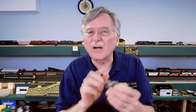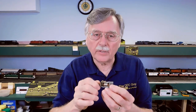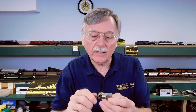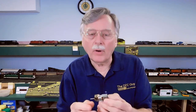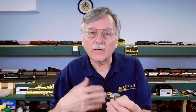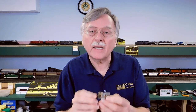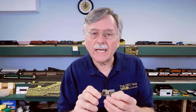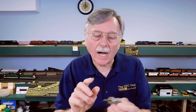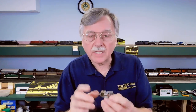Now, under most cases when we start applying power to a motor, it's going to start speeding up and you're going to get a slow increase in the amperage draw and the speed. As it speeds up, your amperage is going to increase — you're pushing more electrons through in order to make it go. Eventually you reach a point where you max out, and under certain conditions you may see a situation where the locomotive wheels start to spin. If you've overloaded the locomotive with too many cars or if you're going up a hill and it can't go, it might stop and just sit there and spin its wheels — that's called a spinning stall or wheel slip. At that point, you can get a very high amperage draw through the motor.